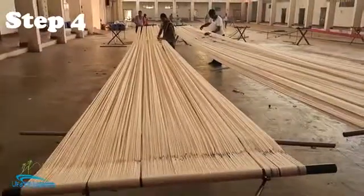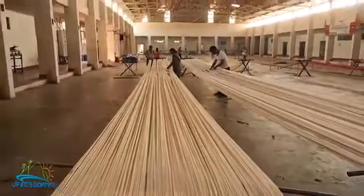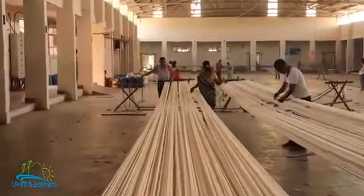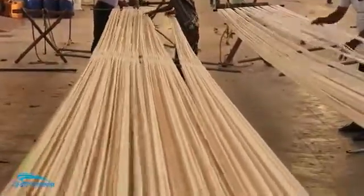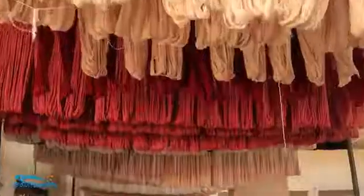This process here is before it goes on to the loom. It's called dressing the warp. They're making sure that all the yarns are there. They're separating each and every yarn. So then once you start threading it through the reed and the heddles, it's all there. It's all tied. See, she's making sure that all these threads are intact and tied. See? She's checking it. So this is before the marking process? No, this is after the marking. This is ready to go on to the loom. Okay.